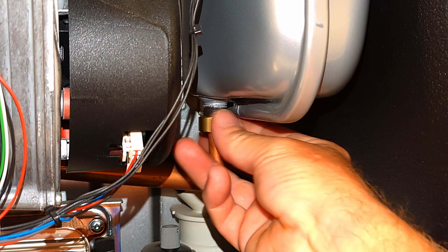With the boiler drained down I can easily check the pressure sensor. I turn the boiler back on, and because there's no pressure in the boiler I should see F22 flashing on the display, warning me there's no pressure. If F22 isn't showing, it means the pressure sensor is over-reading and the low-pressure shutdown isn't working. Now I need to top up the boiler and open the two isolation valves. I use my four-millimetre allen key, turn the flow valve a quarter turn to open it, then do the same on the return valve — both central heating valves are now open, with the screwdriver slot in line with the pipework.